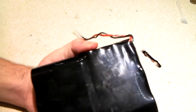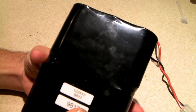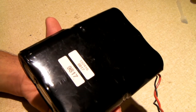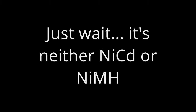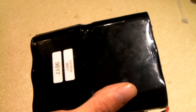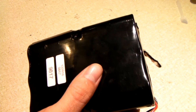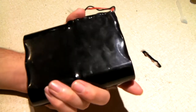But in one of them we had this humongous battery. What's interesting about this battery is the rest of the machines that I cracked open all had lead acid batteries in the back of them, and not this kind of battery. This is either nickel cadmium or nickel metal hydride, I would guess anyway. It's definitely got some weight to it, so I'm guessing probably nickel metal hydride. It's a six-cell battery and there's not a whole lot of info on it. The machine I pulled this from had a 12 volt compressor in it, so I'm going to assume it's a 12 volt battery.